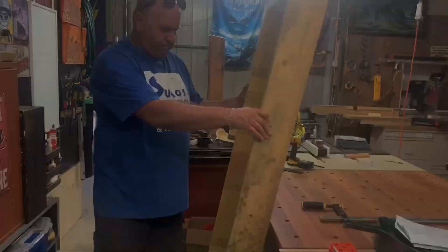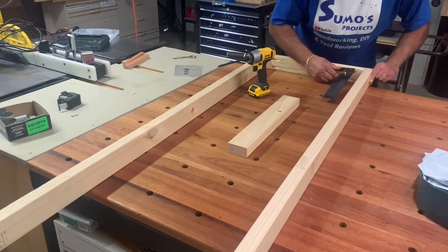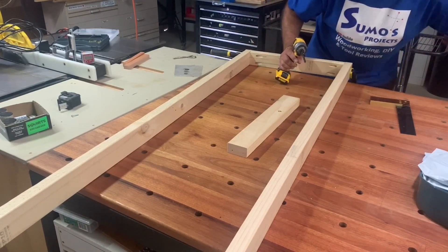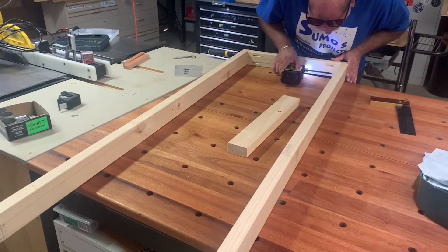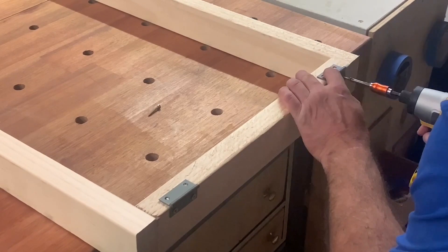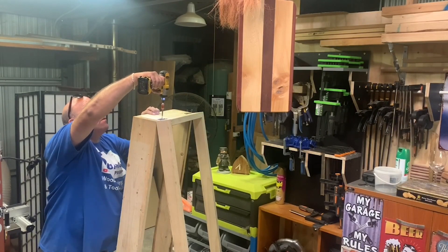This is the front of the A-frame, so now I'm making the backing. This is some structural pine I bought from the hardware shop — it's a little bit smaller in overall dimensions compared to the material I had from my shipping container, but same process, making sure all the heights and measurements are exactly the same as the front. Now adding some hinges — this is primarily to make it look a little bit like an A-frame and it also makes joining the two pieces a lot easier.